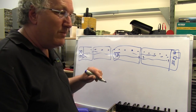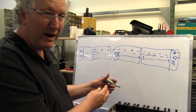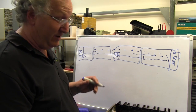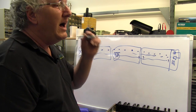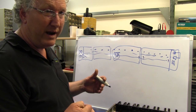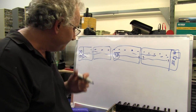Once you get to maybe 200 watts worth of load on the amplifier, it's VI limiting. I'll come to that. We'll start kicking in. But you can talk to an awful lot of speakers. Awesome. And half a watt into a little 4-inch speaker still represents a fair amount of sound pressure level in the carriage, particularly when you've got a number of such speakers spread throughout. It'd be enough.